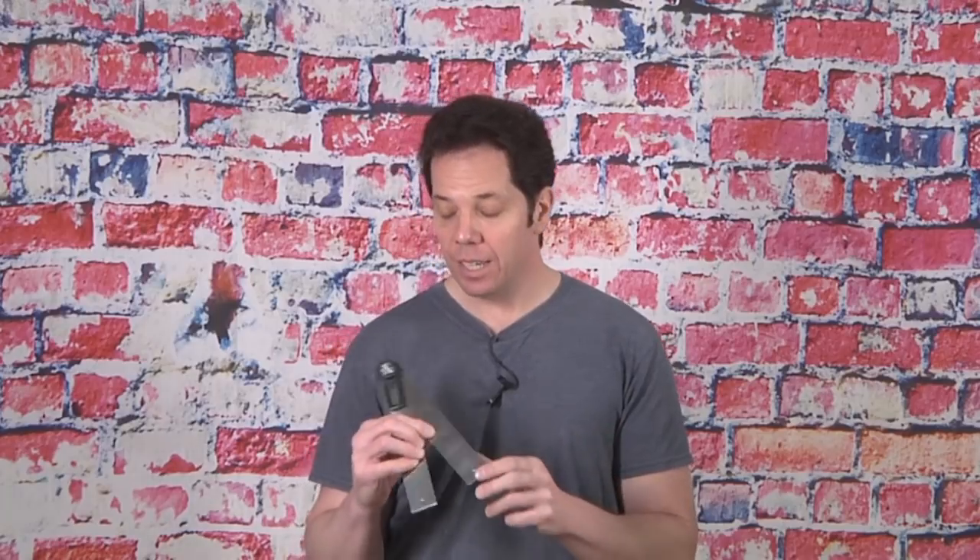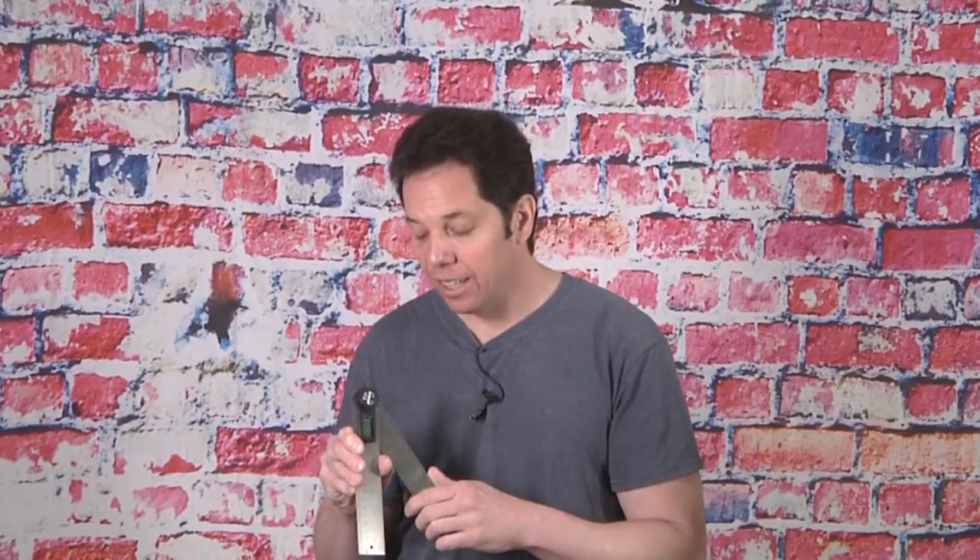It's more accurate than the bevel as well. In all honesty, a few things disappointed me. When I first took it out of the package I was disappointed in the thickness of the metal — I would have preferred something heavier duty, though in the few months I've been using it that hasn't been a problem. Their so-called lock nut doesn't really lock it tight; at best it just adds some resistance, so I have to be careful not to lose my reading when moving it. It also only gives the single cut angle, unlike the Starrett which has a miter cut scale, but that's not a big deal — you just divide the number in half.